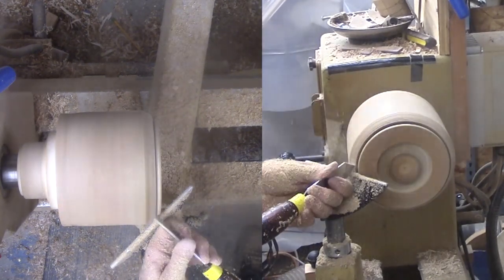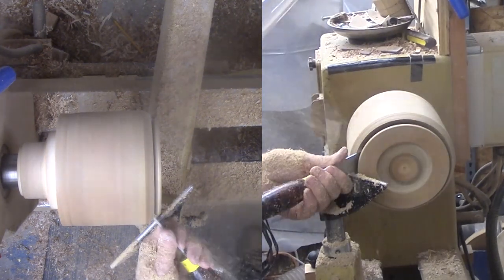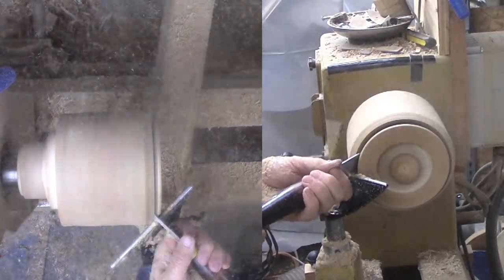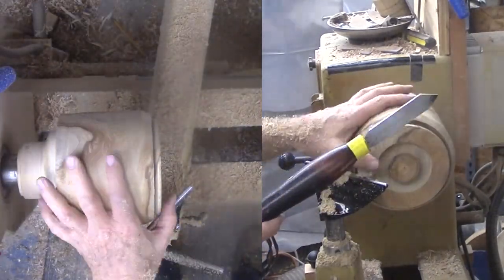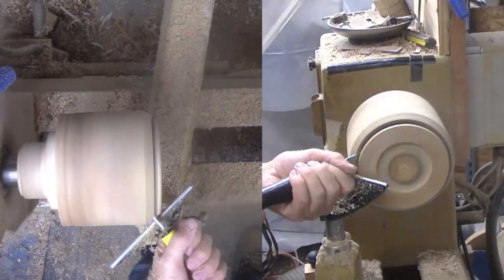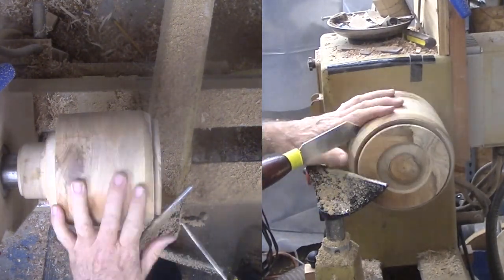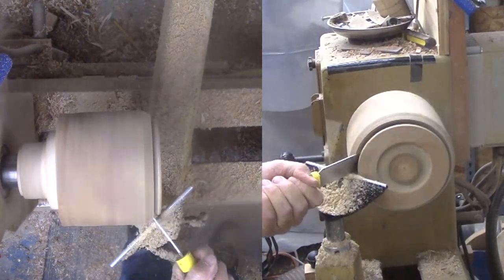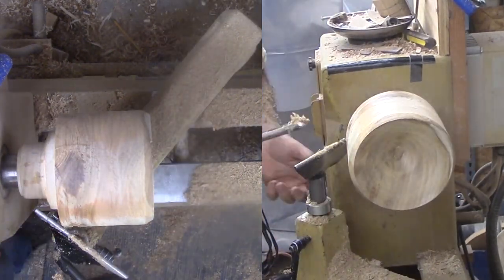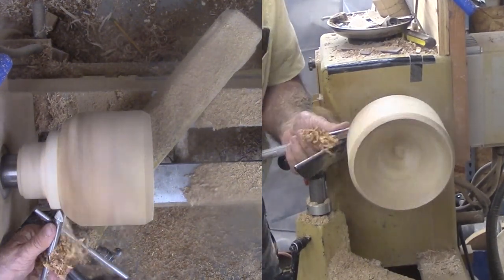The height of the tool requires that I widen the kerf to allow the tool to cut deep into the wood, and it does need to go completely to the center. The wood on the interior does not matter because it will be cut out anyway. However, I have lost a fair amount of wood at the rim — probably less than if I had made a straight cut for the lid, but it was rough going. With the lid successfully removed, I can shape the exterior of my vessel with my bowl gouge. I will let this wood dry, so this is left rough.